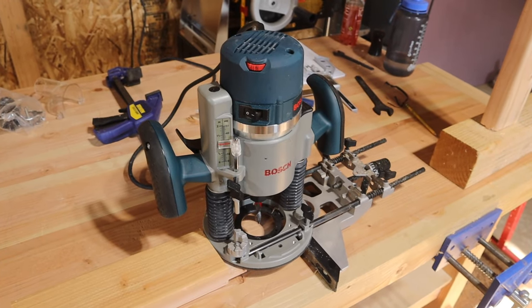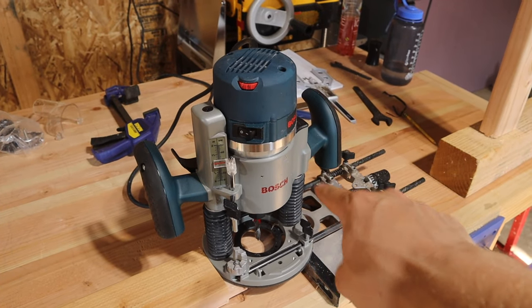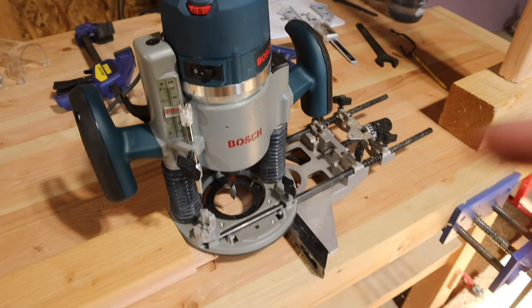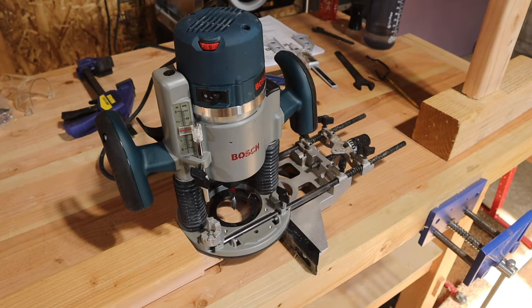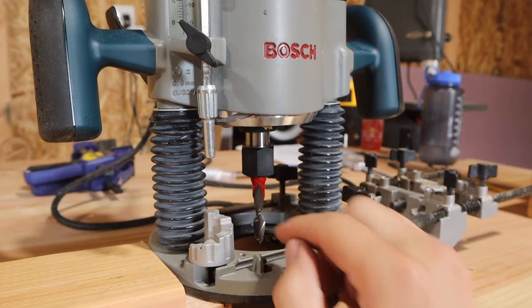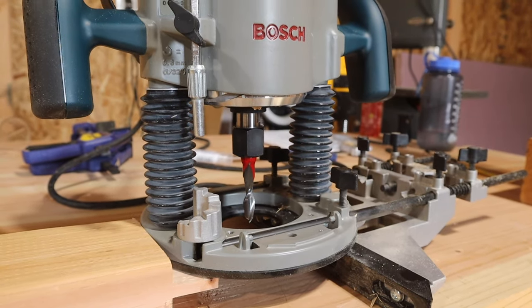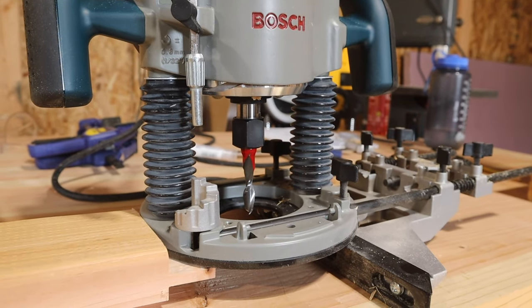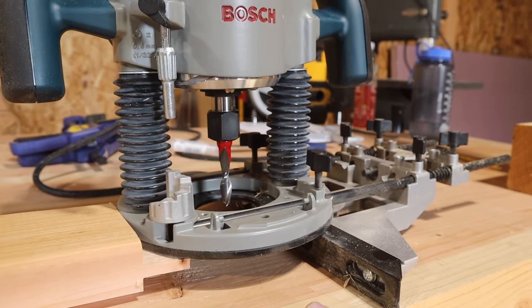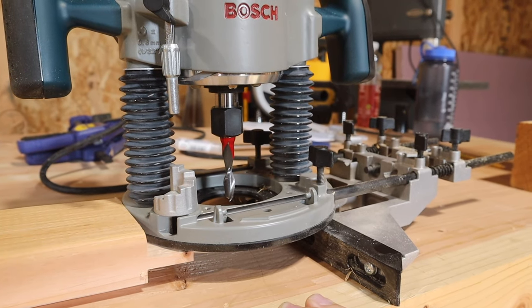So there are three things that you're going to need. One is going to be your router. I have the Bosch 1617, which is on the plunge base right now, and you can purchase this edge finder or edge guide for it as well, so you're going to need that. And then the last thing that I have in here is a Freud 3/8 inch up spiral bit, and the up spiral bit is one that I had recommended by Marc Spagnuolo from the Wood Whisperer. So I gave it a try, and man, it's a lot better than any of the other bits that I have on hand. So worth the money. Go ahead and purchase it. It's like, I think, $40, but I'll leave a link down in the description.